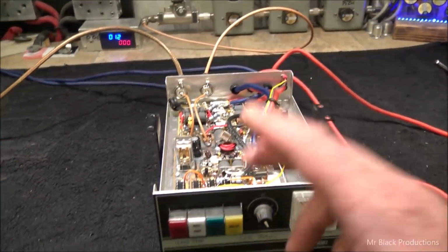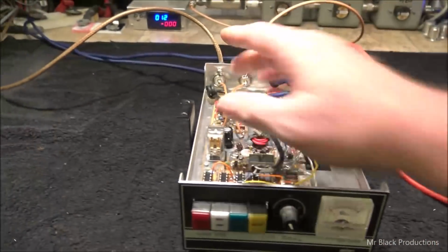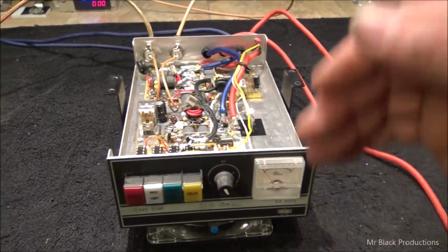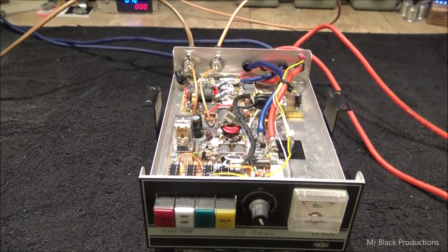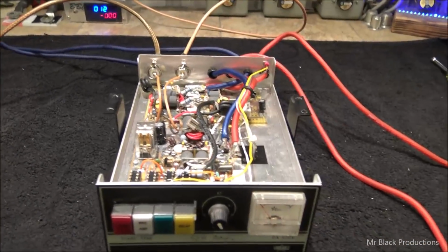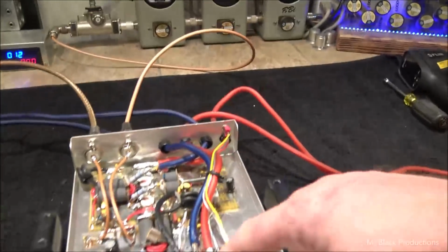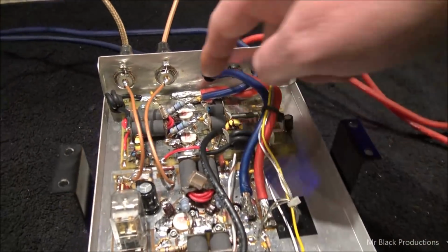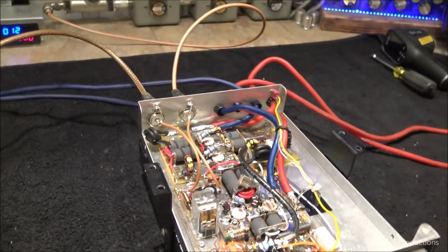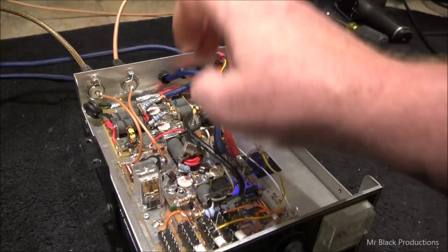But imagine what would happen if this wire worked its way loose. This one right here, that's the one that's hooked to this backboard. All your meters would still be working, but the backboard wouldn't have any voltage whatsoever to operate from. You're going to get a horrible imbalance. These things are going to fry. Not saying that's what happened here, but I am going to go in and add a wire here that comes around and loops over here, so these are bridged internally, and we're going to do that for safety reasons, period. And then we're going to pull this section apart, bloop, bloop.